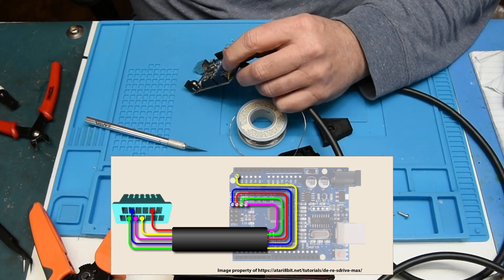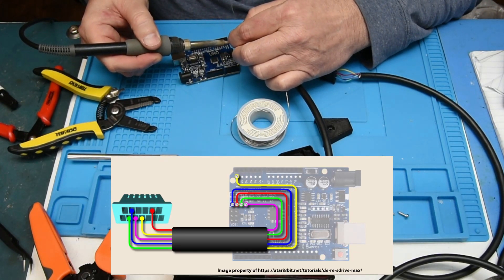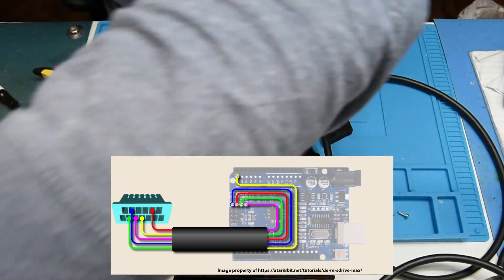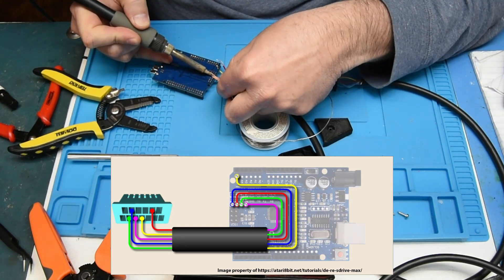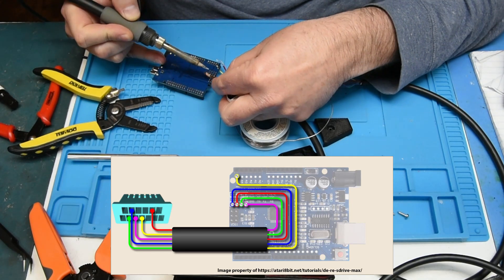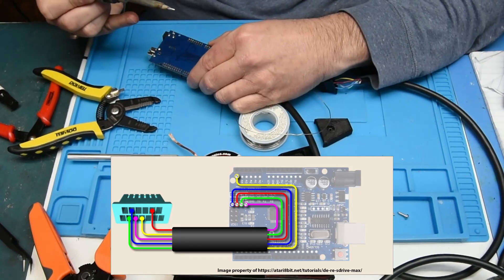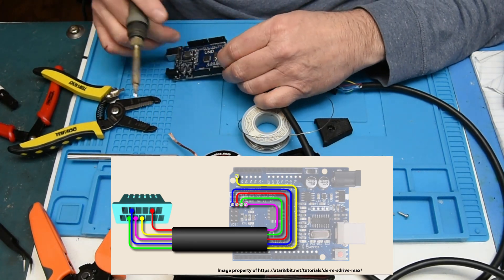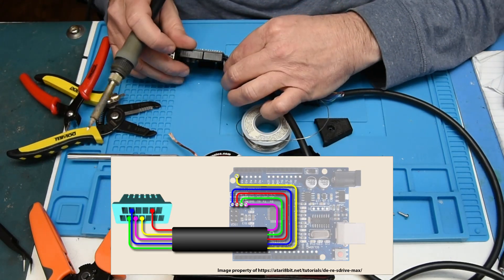I used to solder every single day at work, but not anymore. I'm basically going to clip that off, pull off some more wire, solder it — and because I have solder in that hole I get to go back and clean it. I'll show you how I do that since this is real world. Grab a little de-soldering wick, heat it up. Sometimes you have to add some flux to it, and the other trick is to heat it up and pop it down to get it to open up. So it's going to be blue — yeah, that's better.